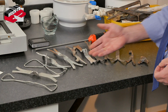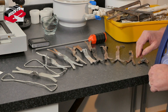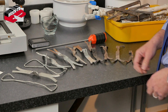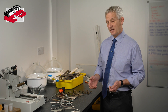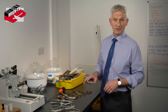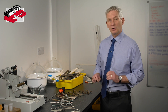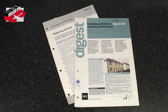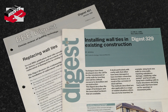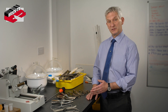What are we looking for? I've laid out a selection of ties here, and it's no coincidence there are about 9 or 10 ties because there are 9 levels of corrosion that we tend to look at. That comes from the guidance via the Building Research Establishment. Gone are the days when the surveyor just decides whether your wall-tie's a ruster — it's not subjective anymore. There's a document, BRE 329 and BRE 401, that tells us how corroded is corroded.